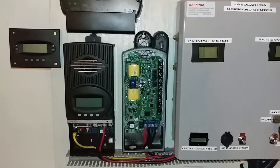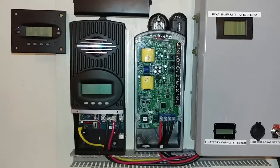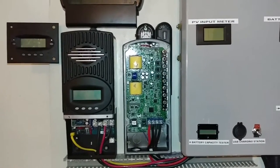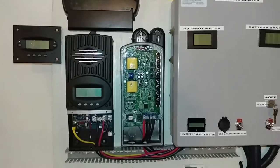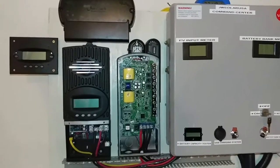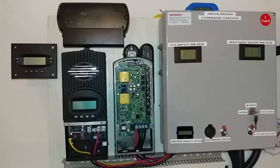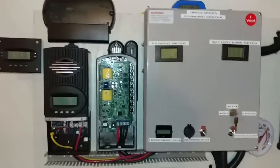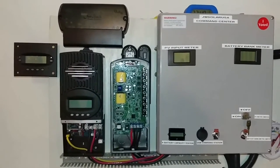This is not an easy job. You've got to take your time and do it right and it's gonna work right for you. With all this upgrade I'm going to be having very good performance, thinking about doing something for the future. I'm getting all these wires already maxed out, especially for the FlexMax 60 — it takes about six-gauge wire. That's the recommended thing for that charge controller.